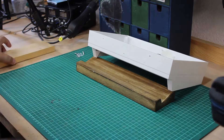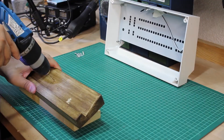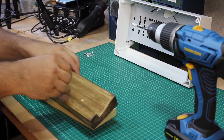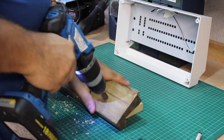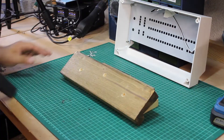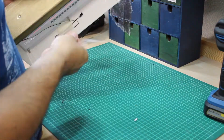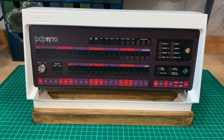It is intended that the entire panel will be placed freely onto the wood piece, but I want to fixate it properly, so I'm going to drill some holes and put in some screws. One challenge is the mounting sequence — there's an embossed area on the backside which forces you to mount the back panel first, leaving no way to secure the screws from the inside. So I drill holes big enough to secure the screws with nuts from the underside. I'll have to briefly disassemble it again to mount the electronics afterwards.